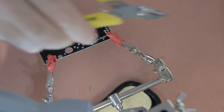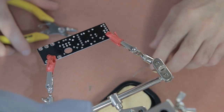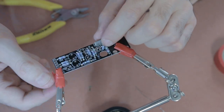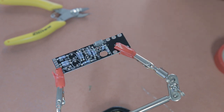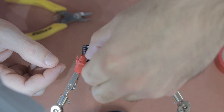Be careful while soldering that you don't cross any connections — no solder bridges between components, as shorts will create problems later. Once the resistors and diodes are done, there's a little silver film capacitor to solder to the board. I taped it to the board like I did with the red Wima film capacitors, soldered the first leg, checked the orientation, then flipped the board back over, soldered the last leg, and snipped it.